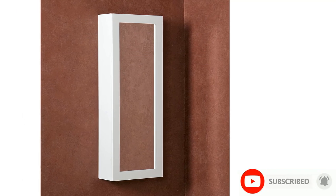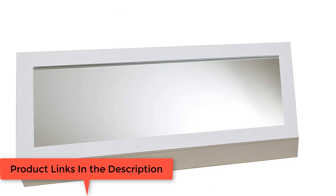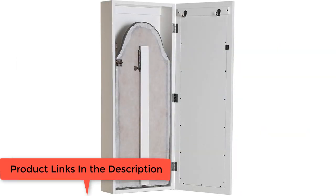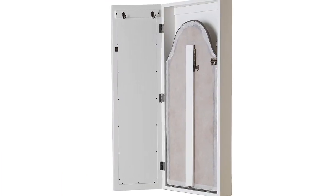The cabinet measures 42 inches high by 16 inches wide with a depth of 7 inches, with the board itself measuring 38 inches long by 14 inches wide and 30 inches on the outside. This size fits perfectly in a standard 2x4 stud, so it won't be a hassle to make a cutout if your house has regular-sized studs. It has three storage shelves, all with a height of 13 inches. The middle shelf is designed as a storage area for the iron, with extra space for accessories, so when you've finished ironing you can place it there for safe storage.